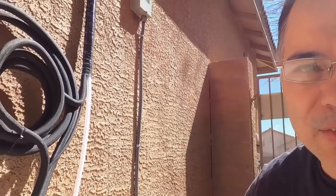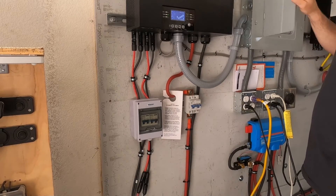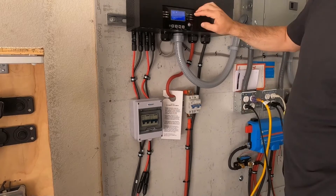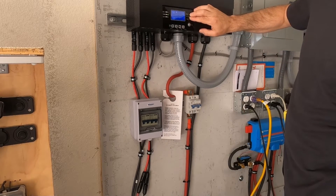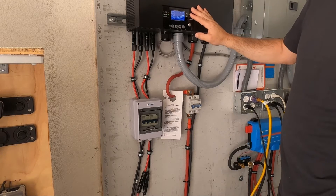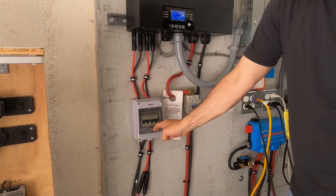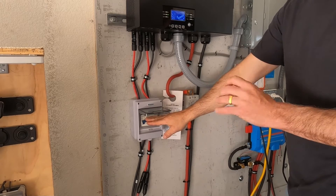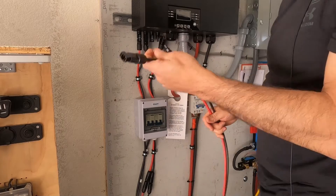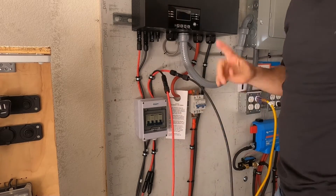Let's go hook it up to some solar and see if we can run it directly off solar. The first thing we're going to do is shut down the system so we can disconnect the PV from the inverter. I turned off the main breaker. There's nothing using the AC power from the inverters right now. So we'll come in and change the PV charging power down to 10 amps. Our PV power went from basically 3,000 watts down to 250 watts, so it's safe to disconnect the breakers at this point. You never want to do that when they're going full bore.